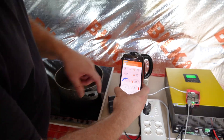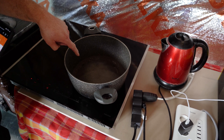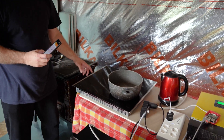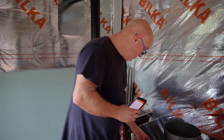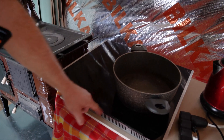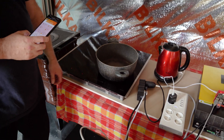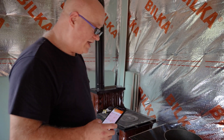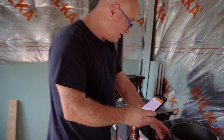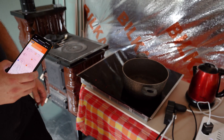Okay, so we're back — the kettle's turned itself off and you can see the power's dropped off. That was a typical kettle boil, probably two minutes or so. Now the water in here is starting to bubble away. These induction hobs are fantastic for cooking because they sense the temperature. If you want to hold a pan at a certain temperature, you just press that and set the temperature with the slider. It's very good because if you want something simmering, after a while you get familiar with the pans and the power needed, and you can just set it to bubble away and cook perfectly. That's holding at a simmer now — I put it on 10 and it's using about 500 to 600 watts.